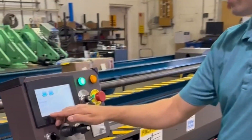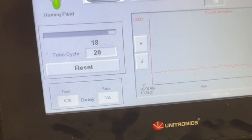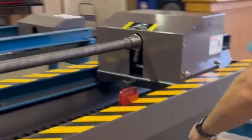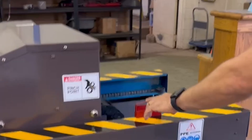The latest feature on the control panel is the lag transition. We have a 0.2 second delay, which softens the change in direction of the honing head as it moves back and forth. Now it's bottoming out, and it will slow down before it changes direction.